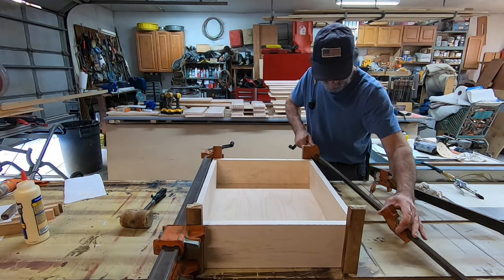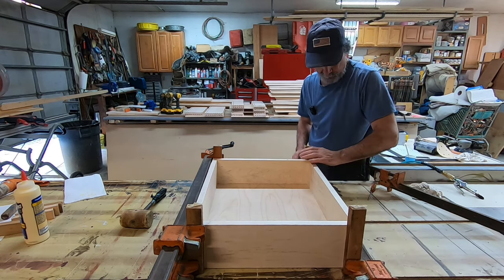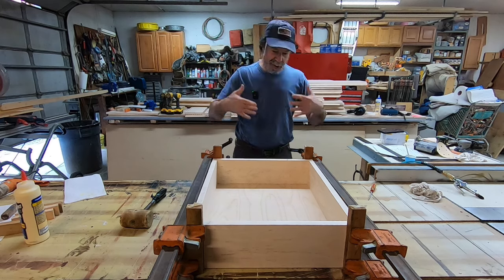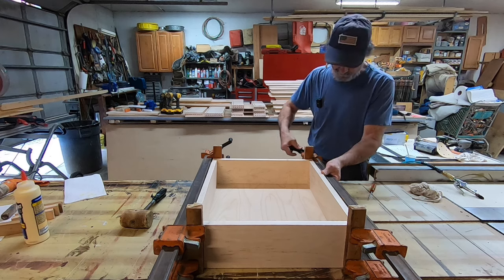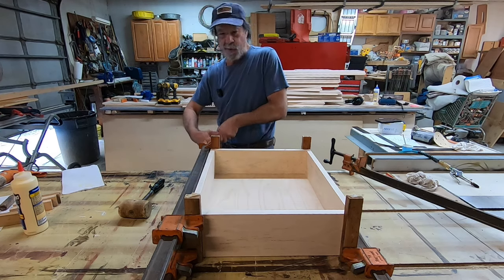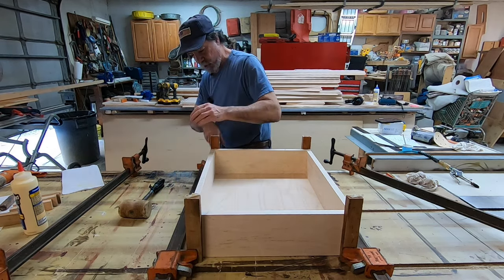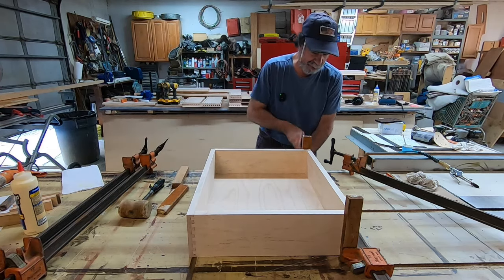Let's beat the glue from drying. Crank that in, and then we're going to release it as soon as I pull it all in. That just pulled everything in all the way — because if you're hitting it with the mallet and there's too much glue in one of those sockets, it's hard to bang in because it wants to just keep bouncing. It's not the same kind of steady pressure as you can get with the clamps. Now once you pull that together like that, we are good.